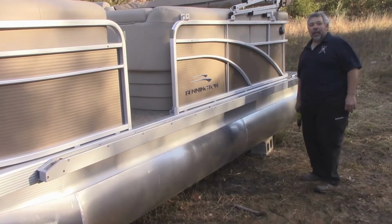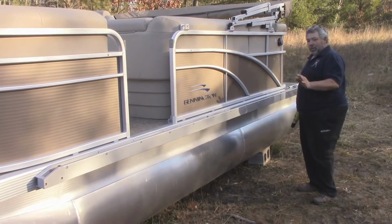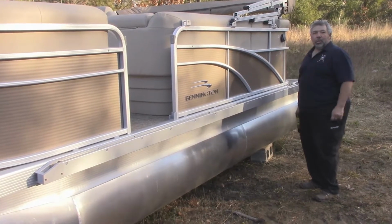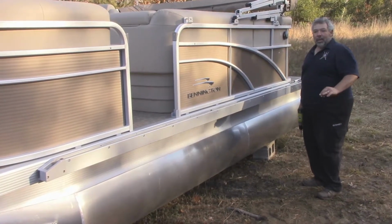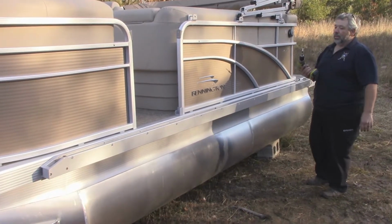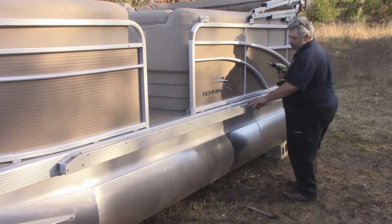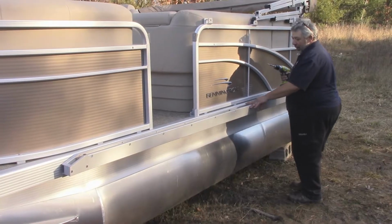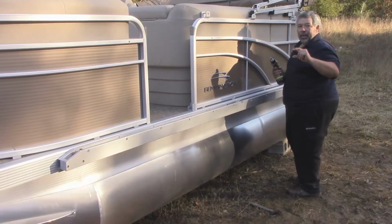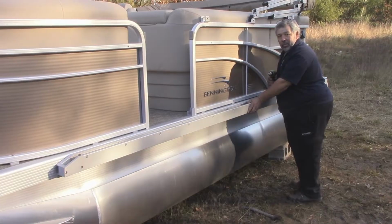Now, considering all that, once you get your rub rail placement, whether it's rounded or flat or whatever, once you get the 3 screws in it, you're pretty much good to go. Okay, then what you do next is you'll just fill in all the rest of these holes with screws. Now these screws are self-drilling, 2-inch, and they screw right through the rail into the rub rail and then into the plywood of the deck. You've got 3/4 of an inch of plywood on your deck, and that's what these screw into. That's why it's such a tight fasten once you get them all in.